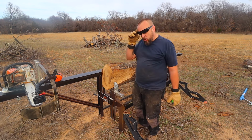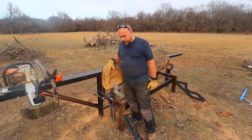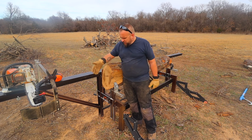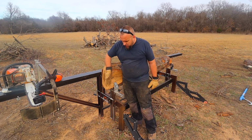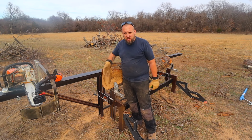I was just putting the cart way out in front of the horse here, because I was only thinking of the fact once I flip this, I would not need to measure for the second cut, because as long as the first cut and the second cut in that scenario are parallel to each other, you've got straight lumber.